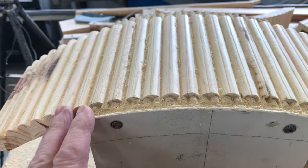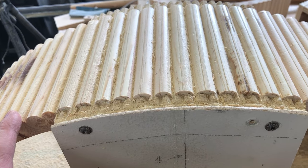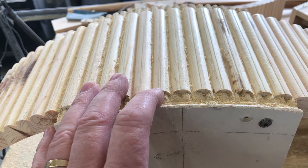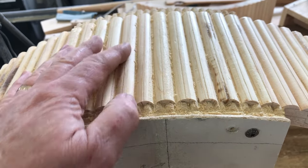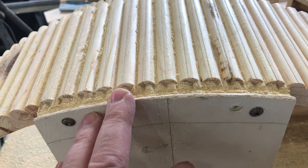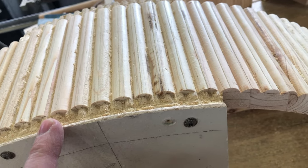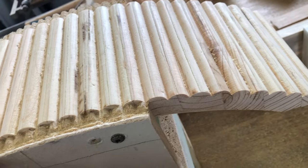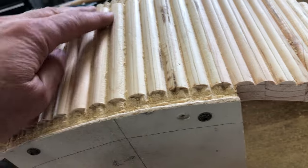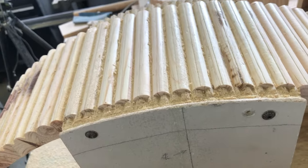I changed tactics just a little bit as I was doing this piece, and rather than making three passes, I changed to just do a single pass, moving slowly, but it made the process significantly faster, as I didn't even have to turn the router off, moving it along from position to position. So, happy with that. We'll do a little bit of sanding to clean out the grooves, and then move on to assembling the legs